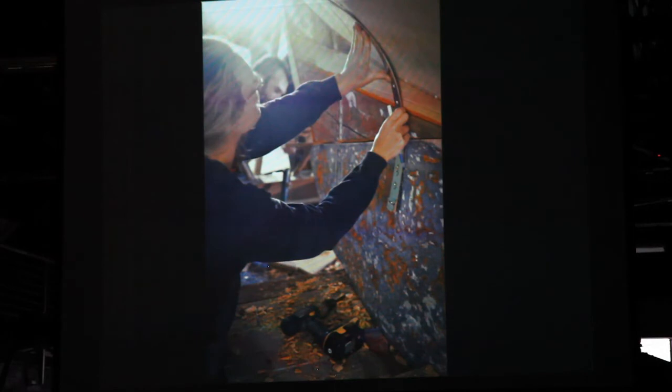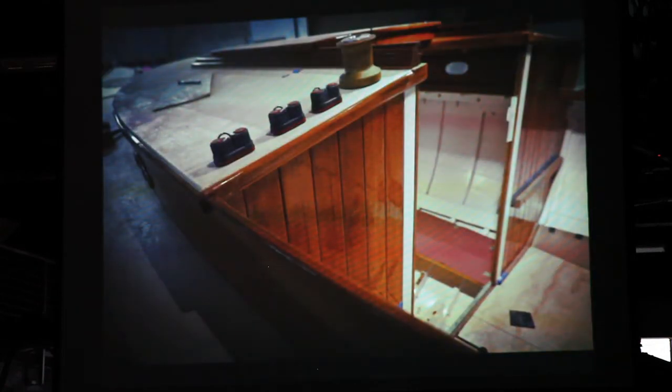We were able to put the bronze keel straps on. The Herreshoff design was somewhat unique in the use of these straps — they don't hold the keel onto the boat; those are held on with the keel bolts, but the straps were designed to prevent wagging. We had Ted — my friend Teddy — select various deck hardware, and he and I went back and forth on it. It had less to do with technology and more to do with sort of religion — boat religion, that is.